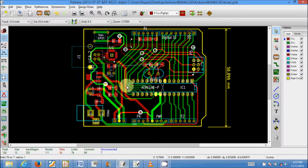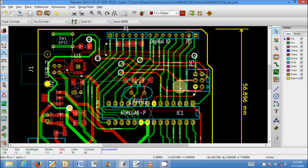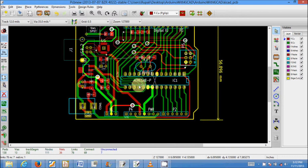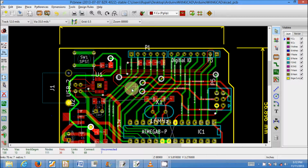In many designs, what they do is, on the top layer or it could be either, one of the layers is made a ground plane, and the other is made a VCC plane. As you can see here, the connections which I have left off are ground connections and the VCC or 5-volt connections, because I wanted to make a plane. To make a ground plane, it is basically to fill copper in the areas which are not routed, where you do not see any copper, you will fill it with copper, either with ground or with the VCC.